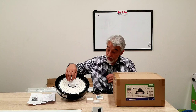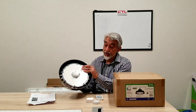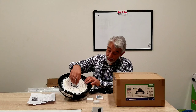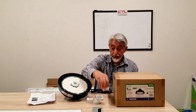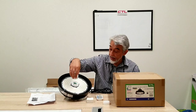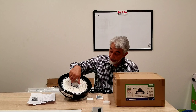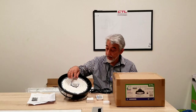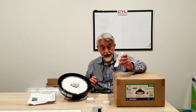The motion sensor is in the center. This is our 150 watt UFO unit — it comes in several different sizes. We're going to unscrew this shorting cap, which is basically empty. This has got the motion sensor in it. You're going to screw that in, just place it right over and softly screw it. You don't want to over tighten, but just tighten until it stops. Then we're going to be setting it with the remote.